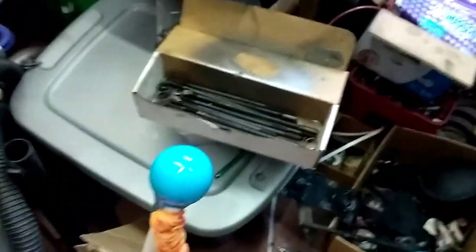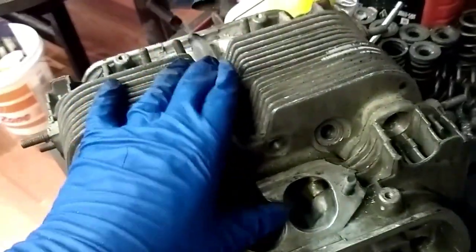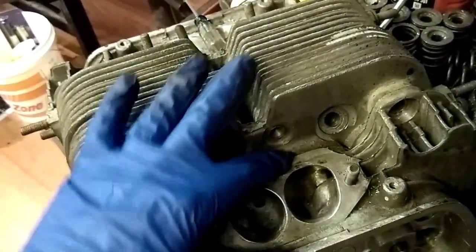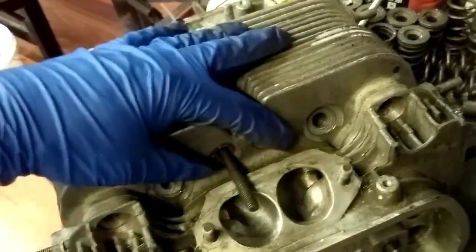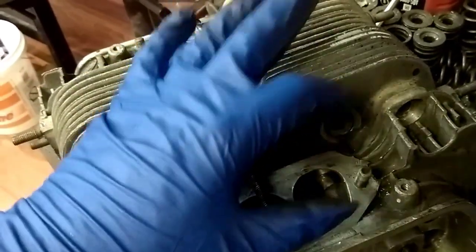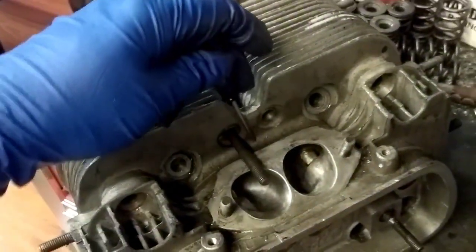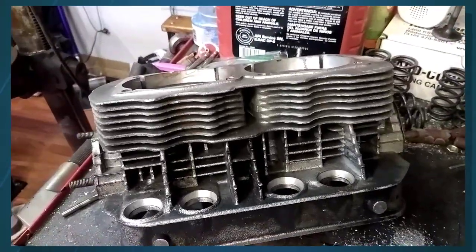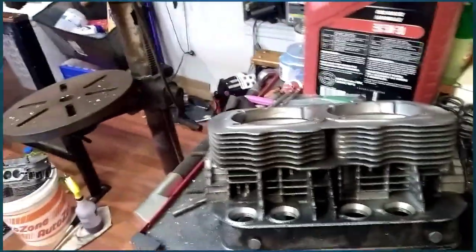When you buy aftermarket engine tins, a lot of them don't come with the spark plug air deflector. This aftermarket engine tin does not have it, so when you're buying engine tins, that's something to look for — if it doesn't have that air deflector it's pretty much garbage. Now some of that will get modified anyway: on the 044s if you have a bigger port, the manifold will be bigger and you'll have to cut that deflector down to fit the engine tin on. In that more extreme case the head will be filled in at that spot so it won't really matter.